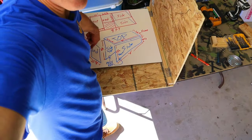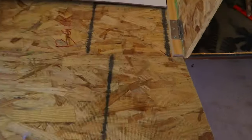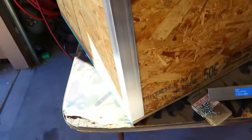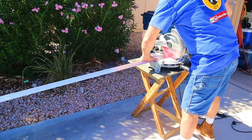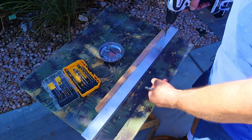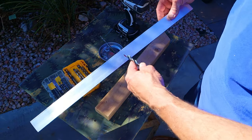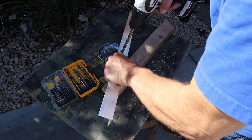Now it's time to attach the end. When I mounted the strips I left them back from the edge a half inch — that's going to allow the end board to slide right in there and span between the two sides. I'm using aluminum angle to connect the end piece. This aluminum angle is one and a half inches wide. I'm cutting two pieces 24 inches long, drilling 11/64 inch holes every three inches down the length. On the side I'm drilling a 3/8 inch hole for a detent pin. To attach the aluminum angle I'm using sheet metal screws.